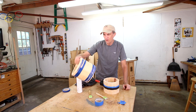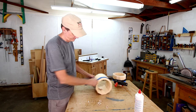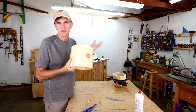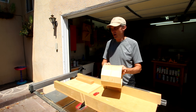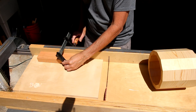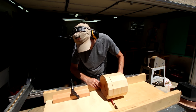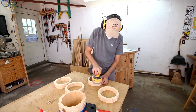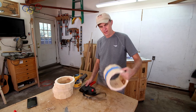Now I can let both of those dry all the way. It's been a couple hours. It turned out pretty good. It really is surprising how strong end grain gluing can be. Obviously I wouldn't want to use it for making furniture, but for something like this it's good. There are several different ways I could slice this up — I could use my rip fence, but I think I'll have more control if I use my sled and this board as a stop block. You can make these whatever width you want.